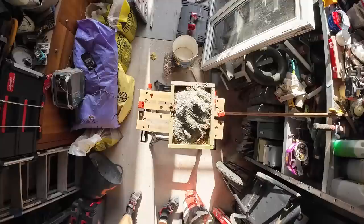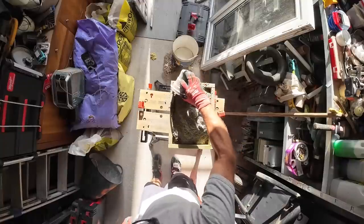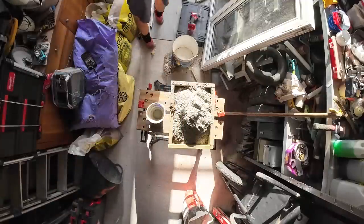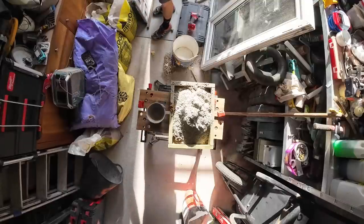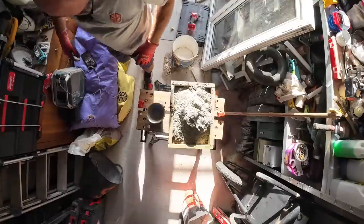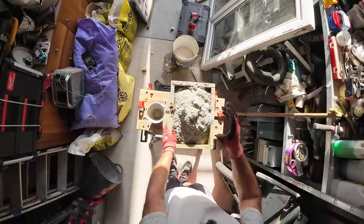And the other 2 padstones we'll be using on the job will be 6x4 concrete lintels, which I think are actually brilliant for padstones because they're more dense than the padstones. And they're reinforced. I'll show you later. I'll come back to that but show you the other one. They'll be cut down to size. So there's our 8, 4, 2 and a little bit.